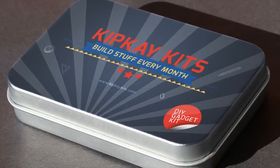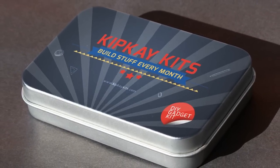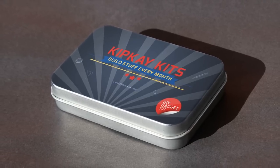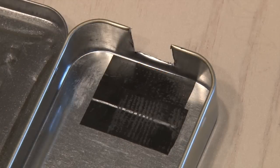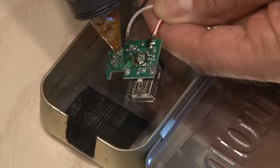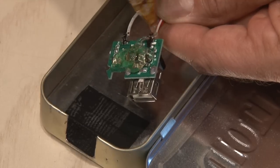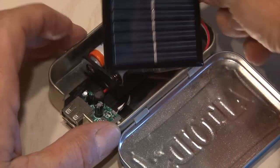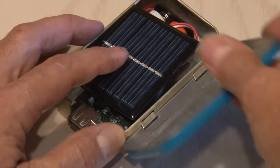If you get the kit from me, you'll get this really cool custom printed tin — it's the same dimensions as an Altoids tin but custom printed just for you. For now, we'll use a regular Altoids tin. I cut a small slot in the side, added electrical tape to prevent any shorting, and applied a liberal amount of hot glue to the bottom of our little circuit. And we've made ourselves a portable solar USB charger — everything fits inside the little tin.